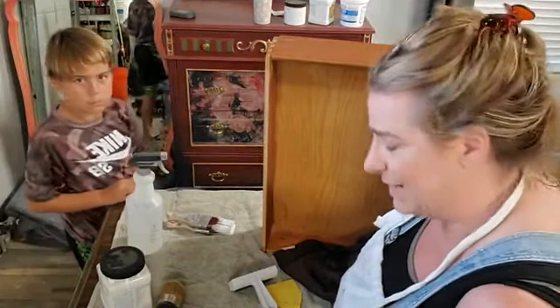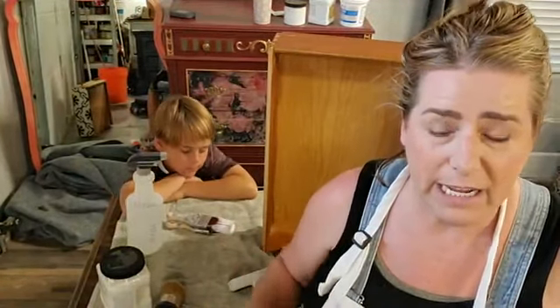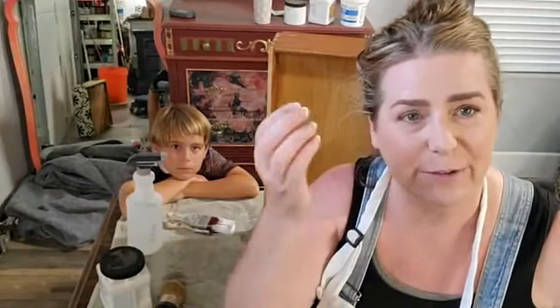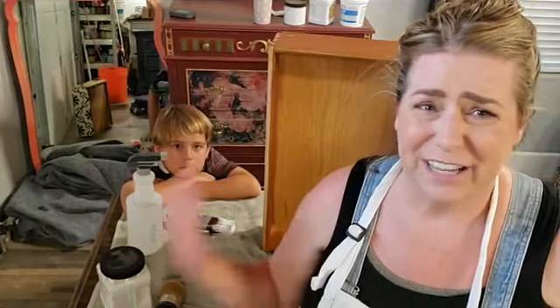How do you clean a velvet drawer? If it's not salvageable — just dirty and gross — I usually remove it with a razor blade and scrape it out. If it's salvageable, I clean it up with a lint brush, spray it, wipe it clean, then use the lint brush. That's about the best you can do. Velvet drawers are not my friend. Felt drawer liners I usually take out because they're so old I don't even try to clean them.